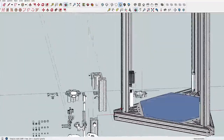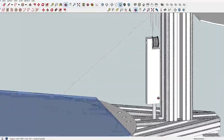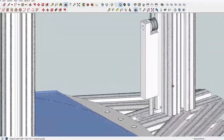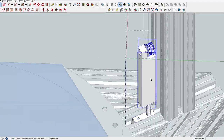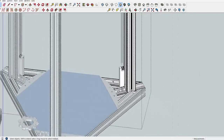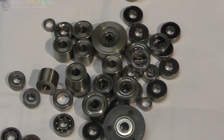Today we're going to be talking about the belt tension idlers. Here they are in the 3D drawing. I actually drew them up second — you'll see in the second part of this two-part video what happened when I didn't draw them first. The most important thing I found on my other printer is getting these belts tight, and the way the original Rostock is set up, it's kind of difficult. I'm making these exactly the way I need to, plus I have them fit so the belt is maximized.